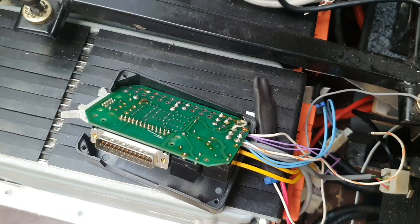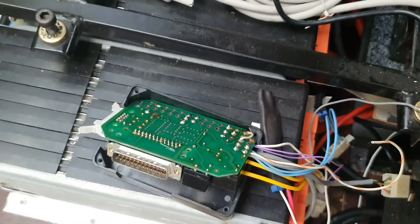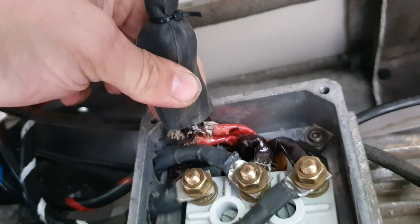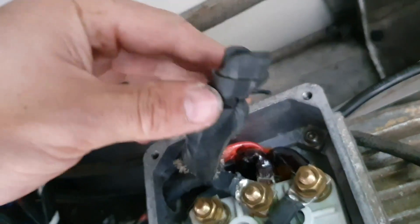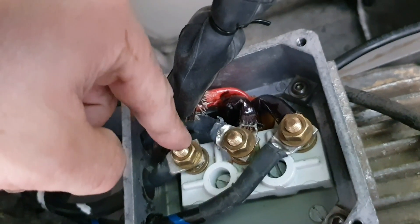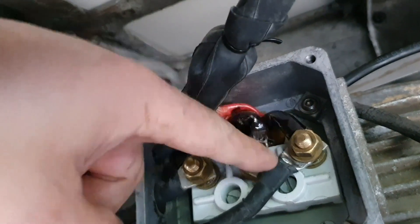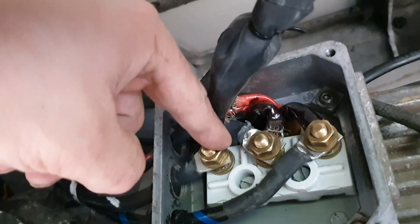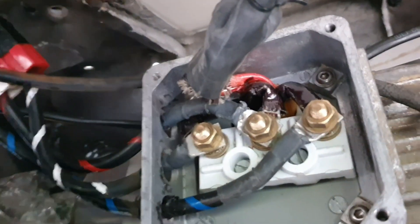So after that, I'll start the car up and see if we've successfully transitioned to star. As you can see, I've taken three off each of the coil wires and just bolted them together and insulated it. This is going to get tucked up in there. These are all back on and I've just tested the car — it does seem to move. So I think we are hooked up in star. We're going to get this all back together and then give it a test to see if it's still overheating.